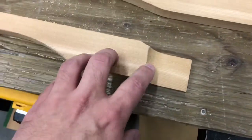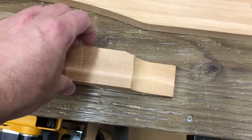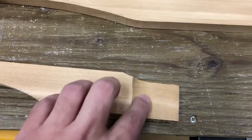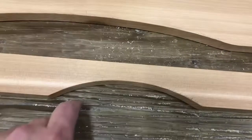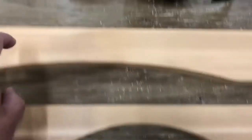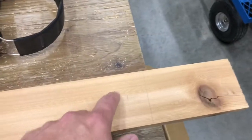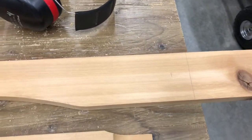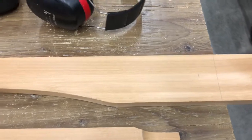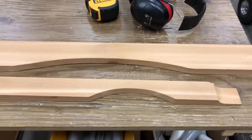So it can tuck underneath the handrail. I've sanded a profile into this — basically trial and error, take a little bit, do some measurements. There's a lip on the outside that I had to put a little relief into, and this has been done on both pieces. The straight one without the cutout is in the basement just in place for a bit. This one I have to adjust — I'm gonna put it on top and then figure out my real lengths for cutting these two ends, then basically glue it in place, let it sit for a few hours, and start figuring out the next part.